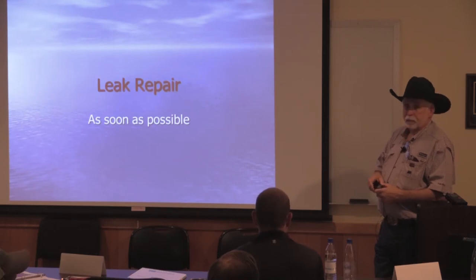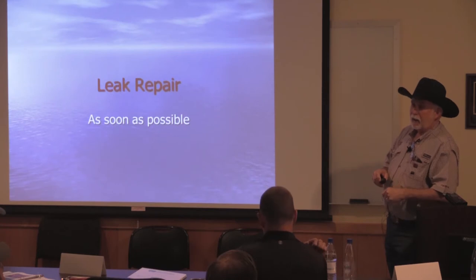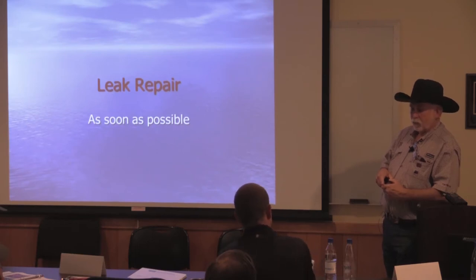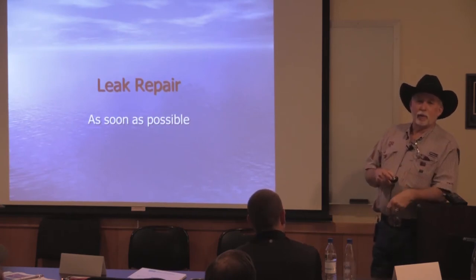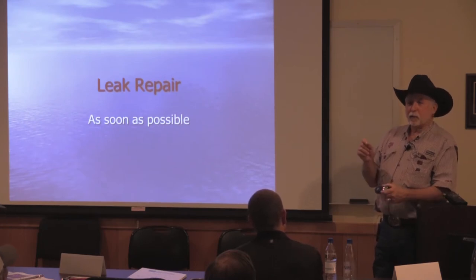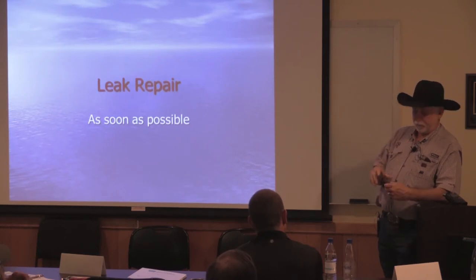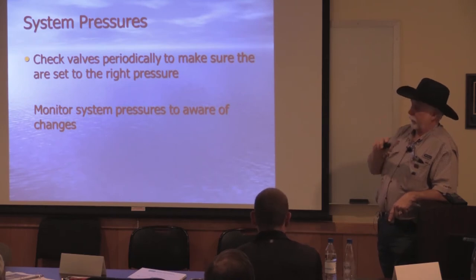So that's the main culprit for your leaks, typically, rodents? Yeah, here it's rodents. I had a lot of problem with the chili folks over at Hatch because they were, what's that word, cheap? No. Fiscally responsible. Let's use that one. Instead of putting in 13 mil tape, they wanted to use 10 mil tape because it was cheaper. But the 10 mil tape was just thin enough that, have you ever seen a mole cricket? Well, hang on. I'll get there in just a second.